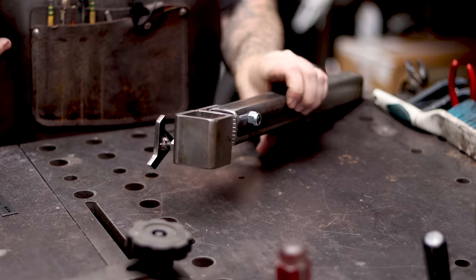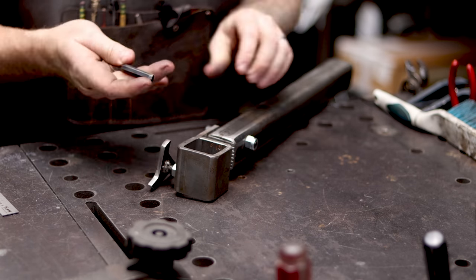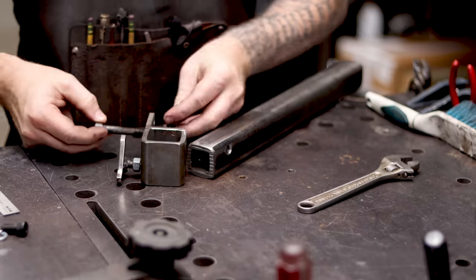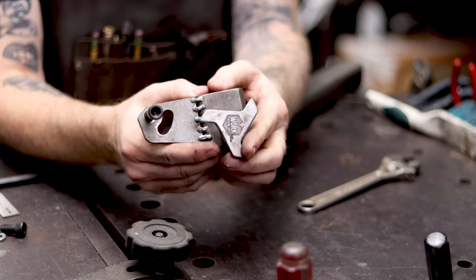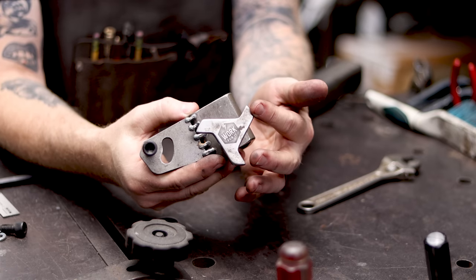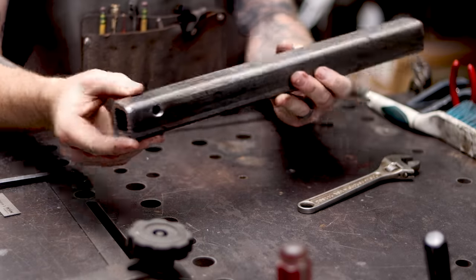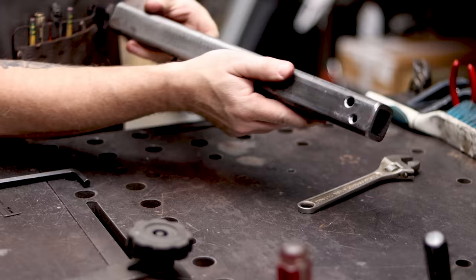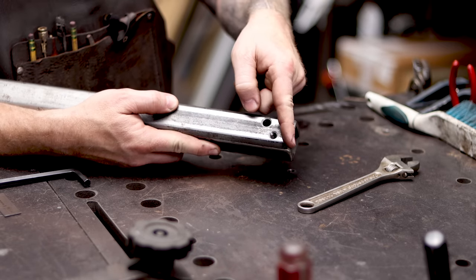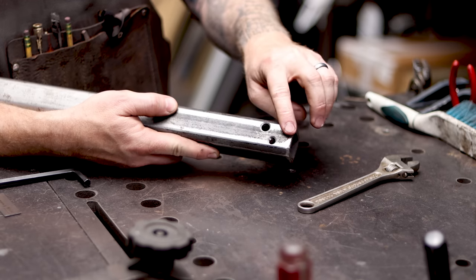The first step is taking the Gen 4 tooling arm that holds the work rest — this is the work rest tooling arm receiver here — and we're going to just unbolt all of this. This is one of the first prototype knobs that I created back when we were working on Gen 4. So now that we've got this tooling arm on its own, we really just need to take and cut a 45-degree angle right along the bottom of this corner. We just need to get rid of this metal right here.